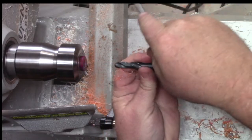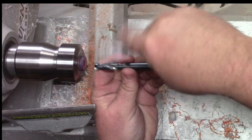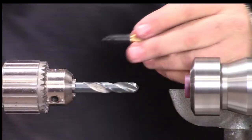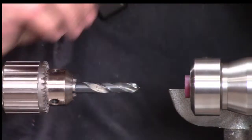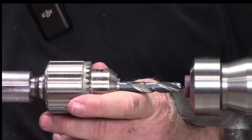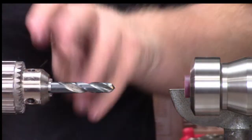And then our last one is a 3/8. And this one is just barely, you're just essentially making a tiny little cut. And if we can see it, the tiny little cut is for this little bitty lip at the top of the nib here. Honestly, it's not going to make it or break it if you go a little deeper. It'll just make your nib sit deeper, so you may want to watch it for that reason. All right, there we go. That should be enough.